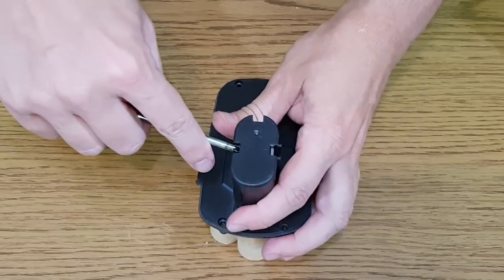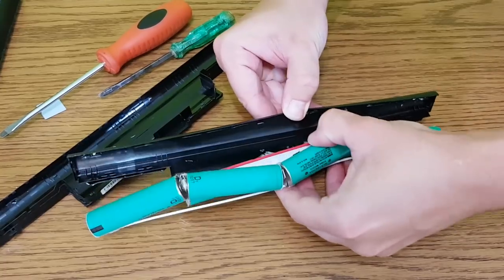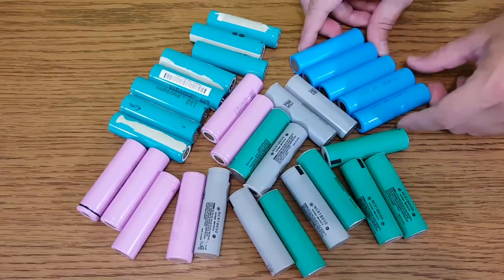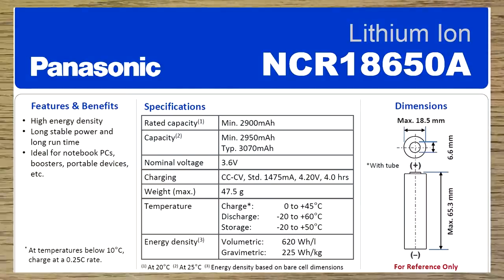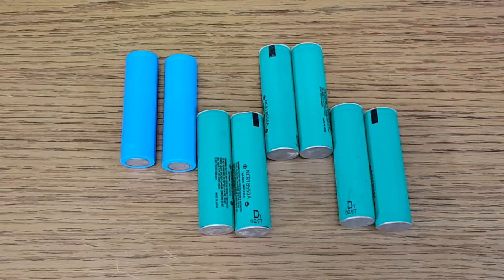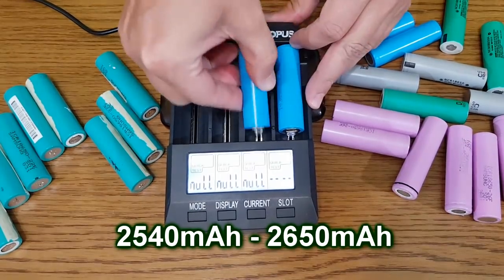The entire purpose of this conversion is to make it as cheap as possible, assuming you already have a laptop battery. Otherwise you can just buy a new original battery or high-current drain lithium-ion cells, which are very expensive. In the previous episode I showed how to salvage and test 18650 cells. These Panasonic ones are the best I have — according to their datasheet they have a typical capacity of more than 3 amp-hours and a maximum discharge rate of 2C, so these cells could deliver a peak current of 6 amps when new. Right now their real capacity is around 2600 mAh.